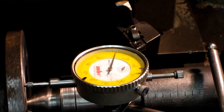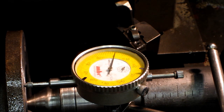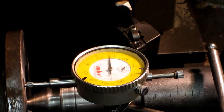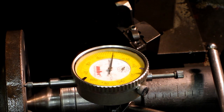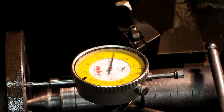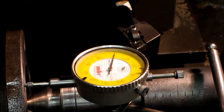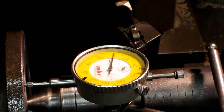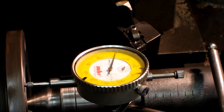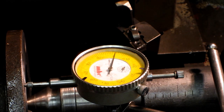Oh, almost zero, but it's not tight. It's spinning on there. Alright, now I'm going to go ahead and retorque the coupling, same way I did before. Rolling it over and bringing the torque up as equal as by feel. I'm not going to set the torque wrench for increments all the way through like you would be torquing a head or whatever. Just basically want the two final tensions on the coupling to be equal. And the main thing is so that it repeats. There you go. You got a good idea. It does have to be torqued equally. And I do it here in the shop. I expect you to do it down on the boat.